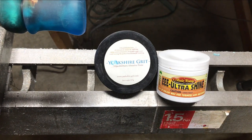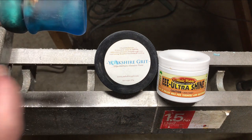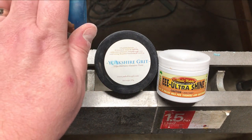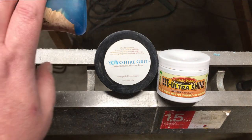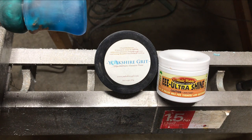So here I want to talk about a couple of products, and I've changed my sanding schedule a little bit so that I'm only doing basically five runs of sanding. I do one run of 220 after cutting — with the lathe spinning and then stopped, going back and forth with it turning the other direction. Then I do 400 the same way. Then I do a wet sand of 600, and I do the first two micro mesh — the 1500 and the 1800, the brown and the green.